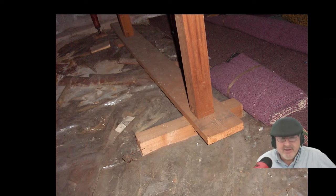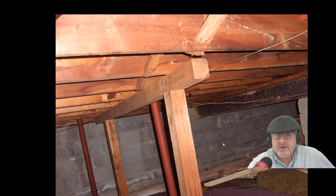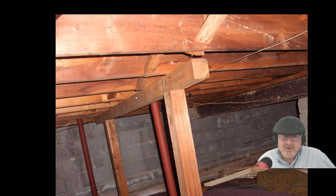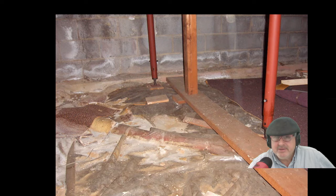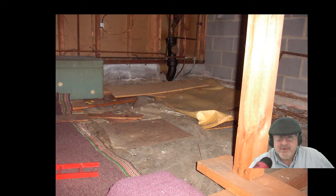The load here is on dirt — they put plastic down at least so it won't rot, but it's going to settle. Not only that, it's sloped, so that's not going to work too well. This wasn't even necessary originally — it was added later because floor span joists were very long and floors were deflecting. If you bought this house and saw this, I wouldn't remove them. Leave them there because once you remove them everything will go crazy upstairs — you've got to work around this. If you fix the house and jack it up, now the doors don't work and you have to replace them all. You want a footer — not a good idea without one.